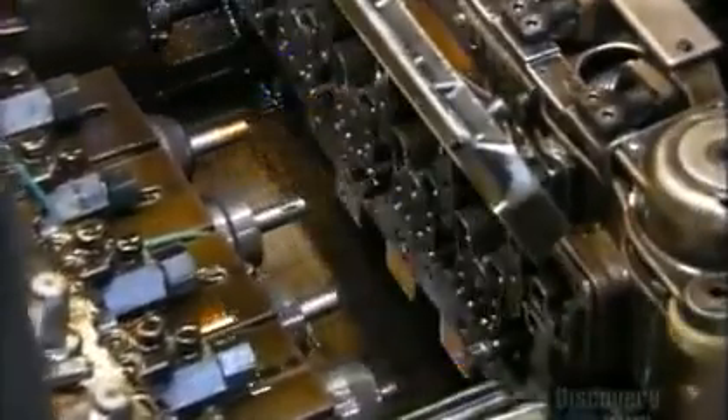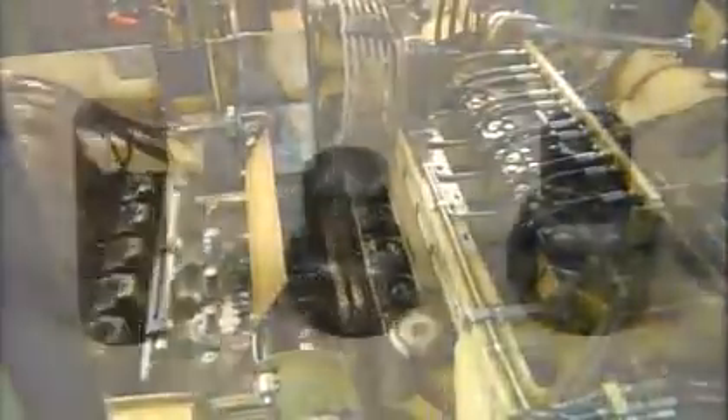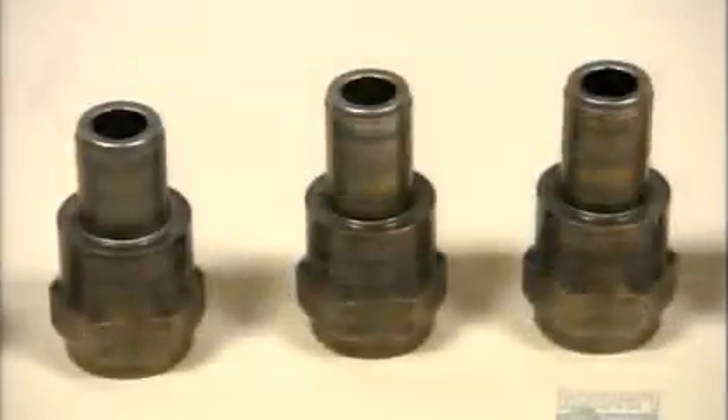While the insulators are in the kiln, tools ram steel through shaped cavities called dies. They're essentially punching out shells that will be the spark plug casings. Other tools bore into the upper part of the shells to give them a hexagonal profile, which will later enable mechanics to wrench them into a vehicle's engine block. More tooling contours the spark plug shells, and the result is quite a transformation.